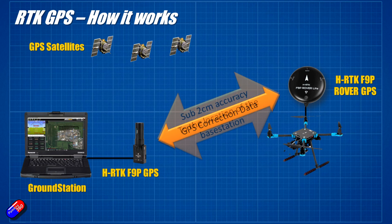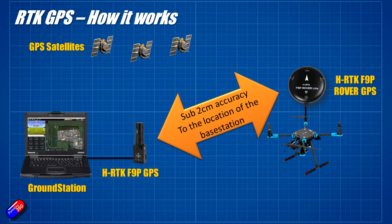There are a couple of main uses for RTK. It can be used for navigation, or some people will use it for mapping. The accuracy is relative to what base you use — whether it's your own base or an NTRIP service. Benefits for navigation include highly accurate, repeatable flight paths, improved return to home accuracy, and landing on the same spot and repeating a pattern.